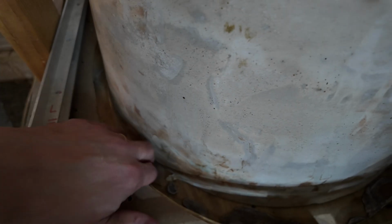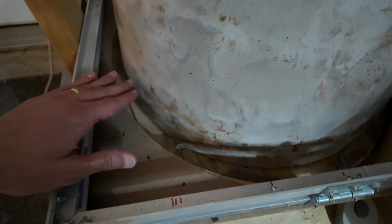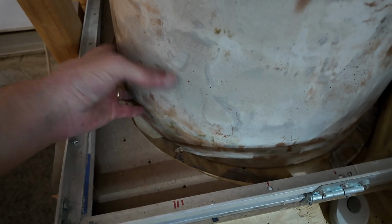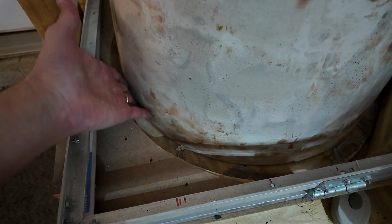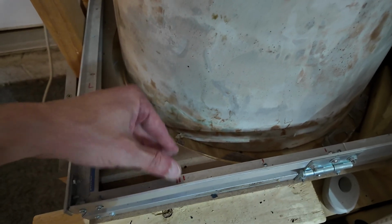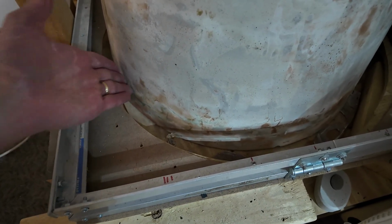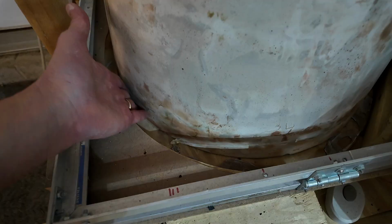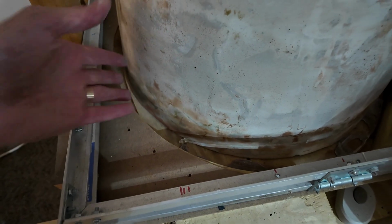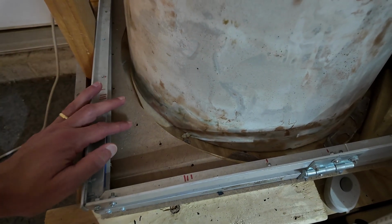And even still, I could only pull the dome all the way to the base of it here. I couldn't pull it any further, past here. It was flaring out a little bit. I think the next time I pull a dome, and there will be some next times, I need to take this plug and just raise it up a little bit on a few pieces of wood, so I can pull past it. That'll solve the issue with the frame as well. Being able to pull it down a little bit more, I'll get that extra few inches, and hopefully it'll also be a little bit more snug here. If not, then I'll have to investigate adding some suction, basically making this into a big vacuum table.